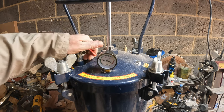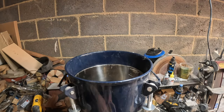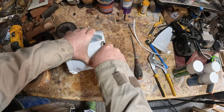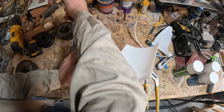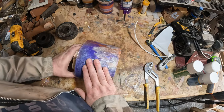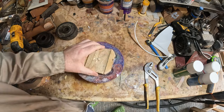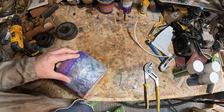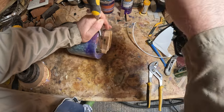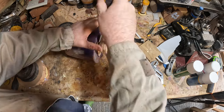Another day has passed and it's time to check on the main blank. As soon as I got the blank out of the pressure pot I was having problems — I'd forgotten to wax the casting bucket, and no matter how much I tried I couldn't release it, so I had to cut it free. Once it was out, all looked good. The void around the waste block didn't matter as this would be all hollowed out. The only thing I wasn't happy with was the top — it was a bit rough and not level, so I chiseled away the excess waste block to get it ready for the drum sander.